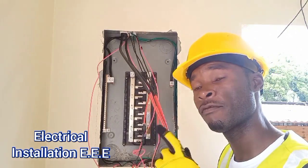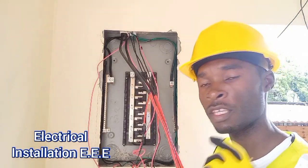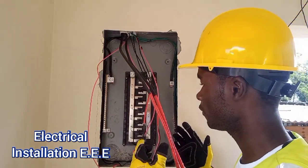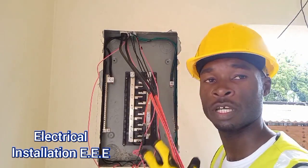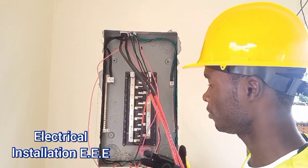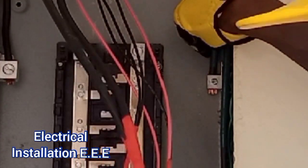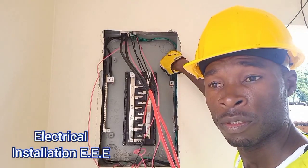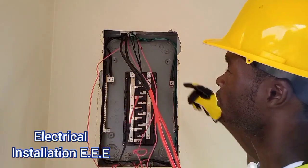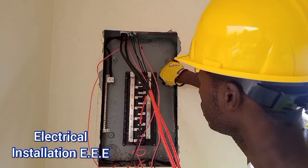That is one of the things I specified in a previous video. I hope you guys understand why we separate the neutral from the ground in the sub-panel — because we don't want current to travel back to the main source or transformer on both paths; we want it to travel on one. Also, with the ground right here, we want the potential difference to be zero — and when I mean zero, I mean 0.000. If we should link it here, there's going to be amperage on the ground side, and we don't want that.